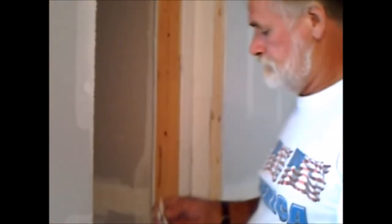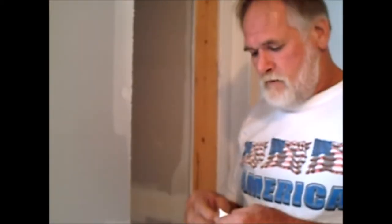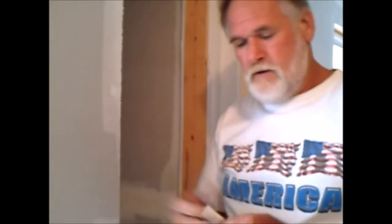Now, I'm going to grab some tape over here. And we're going to take our tape and roll off about an 8 foot section. I like to measure it from the joint to the ceiling here on this top board on a horizontal hanging job. And we can just rip that off, and we want to fold it. Put a nice crisp crease in it, and you can do that by wrapping a few fingers right into the crease and holding it this way and running it over your index finger. With these fingers here into the crease, you just pull, and you'll be creased just right, and watch out for those nasty paper cuts.